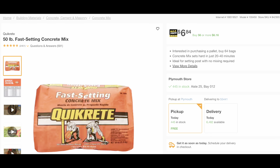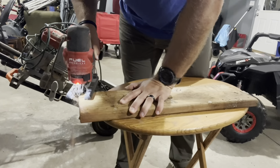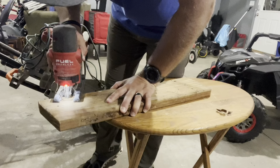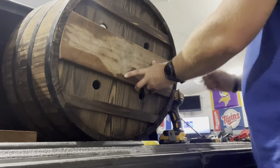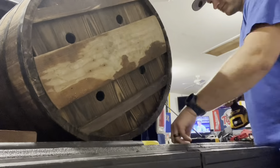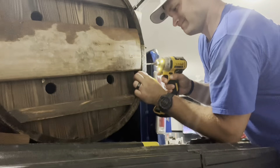I'm also going to need some concrete. I used fast-setting Quikrete and about two hundred pounds for each flower pot pole mount, so about eight bags total. Let's get started building the actual pot holders. Mine had a little damage so I wanted to sturdy them up. I put in one-inch treated lumber on the bottom and fastened it to the sides into the metal banding, creating a more stable base — because we're going to be putting a lot of concrete in and we don't want it to break. Cut those pieces, put them in with some screws to strengthen things up.